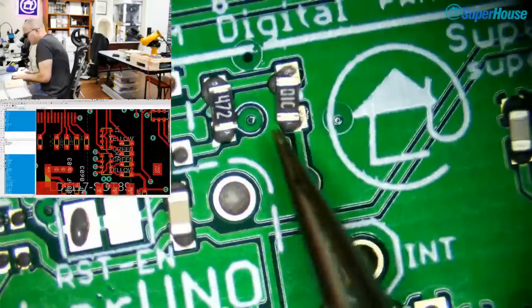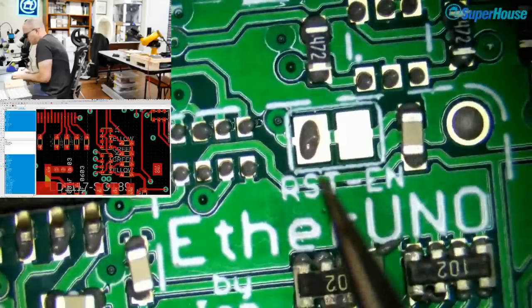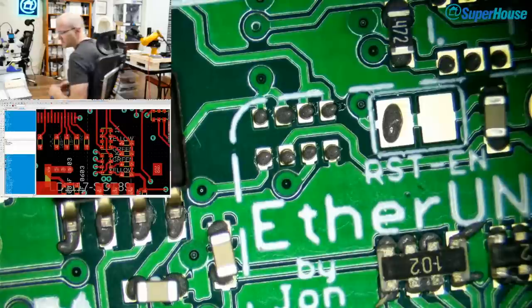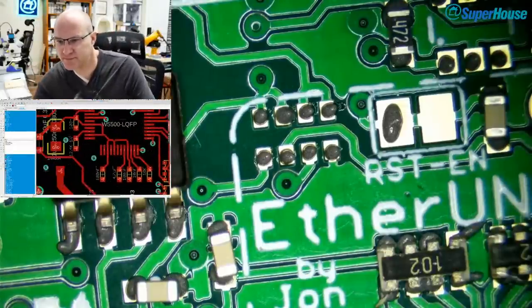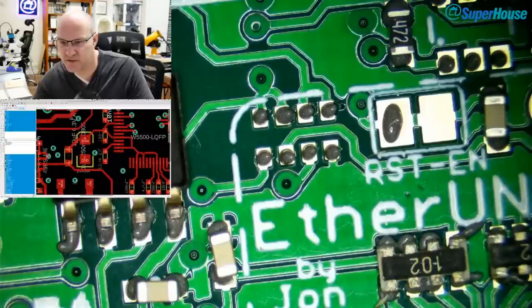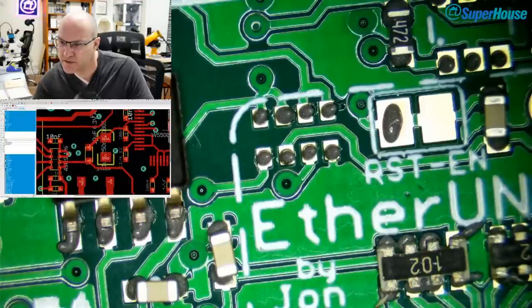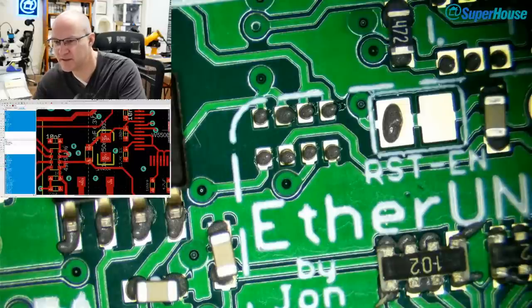1K is a lower value than I would normally use on bias resistors, particularly if the bias resistors need to be overcome by something else. Like if you've got an input that you're pulling in one direction or the other, and then you want to be able to overcome that. What is that one? 10 microfarad, one. Oh, 1 microhenry, there it is. So there is the inductor.